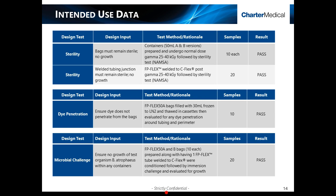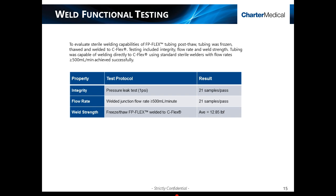Combined with the collected physical test data, a number of studies were performed based on the intended use of the FP-Flex products. In addition to general sterility testing, dye penetration testing was performed along with a microbial challenge to ensure the containers, tubing, and welded junctions maintained a sterile barrier following exposure to the intended product applications. The critical aspect of the new FP-Flex tubing is its welding ability — specifically the ability to weld post-frozen storage and thawing to itself and also to C-Flex tubing, the industry standard for bioprocessing. FP-Flex tubing samples were exposed and stored in liquid nitrogen, thawed, and welded. All samples passed the integrity, flow rate, and weld strength test requirements.